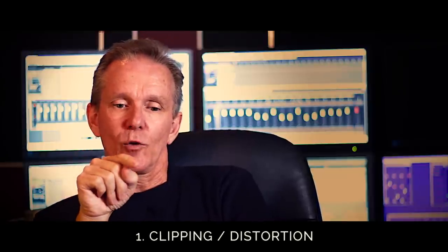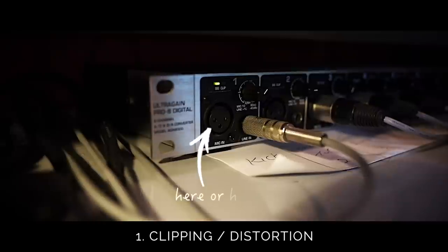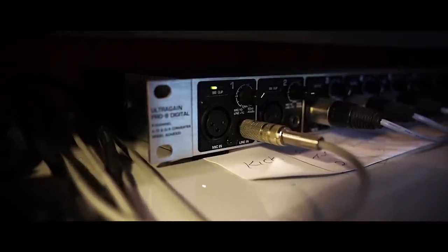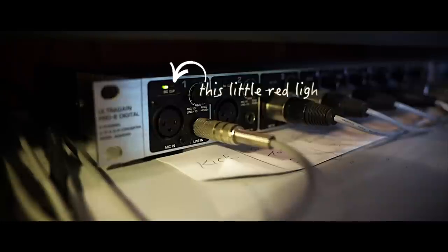So let's talk about clipping. Where does that happen? Your clipping is going to happen primarily where your mic plugs into your audio interface. What you've got to watch when you're recording at home — you've got your audio interface with your mic going in and there's a preamp on there. A little knob with the preamp. And that is where most of the clipping happens.